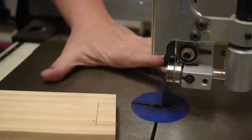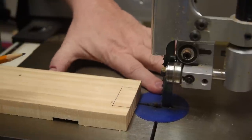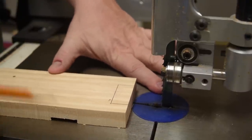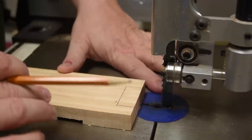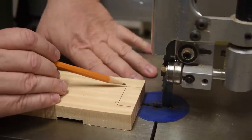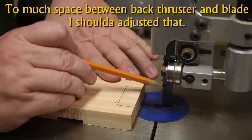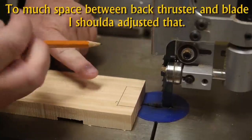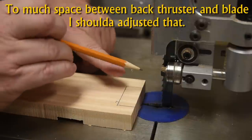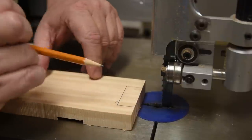It's all a matter of using your fingers as a brace and controlling the angles with your thumbs, with the other hand pushing forward. I'll show you how to get tight corners by utilizing the teeth, since the teeth are actually crossing over on each side — one cut to one side, one cut to the other, then the center tooth to scrape it out.